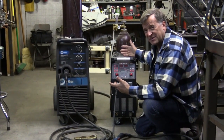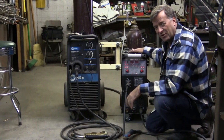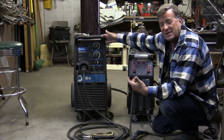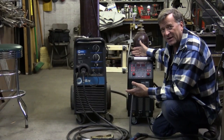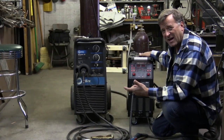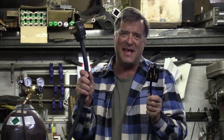Check out the size difference between the two machines — they're both 250 amp machines. An old transformer machine versus a newer inverter machine. You get a lot more functions out of the newer technology. I keep the old one around for sentimental reasons, and if I ever have somebody else here we've got two MIG welders we can run at the same time. But newer technology makes more sense — uses less power because of inverter over transformer. Look at the difference in the size of the wire: the Miller pulls about 50 amps maximum, the Longevity pulls about 25. You'll see a difference in the power bill.